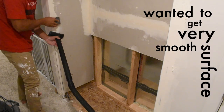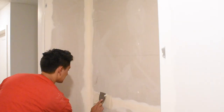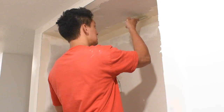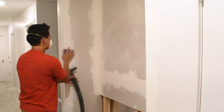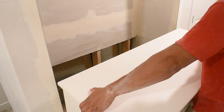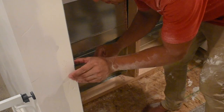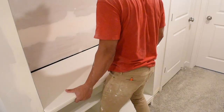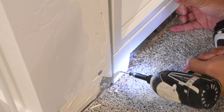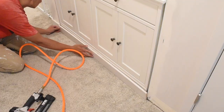Keep mudding until all your corners are done and all gaps are filled. While the mud was drying, I fastened down my corner beads, covered them with mud, made it all flush, and prettied it up. Make sure all this dries completely — which can take a day or two. Then I got my sanding block and a vacuum because it's dusty, and sanded it all down. You can also do a wet sand to complete the finish. If you see tape poking through after sanding, reapply mud, let it dry, and sand smooth. I then installed the IKEA shelf, secured it with wood screws pre-drilled into the subfloor, attached the drawers, doors, shelf inside, and baseboard at the bottom with a nail gun.